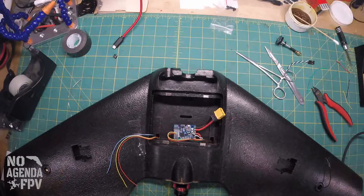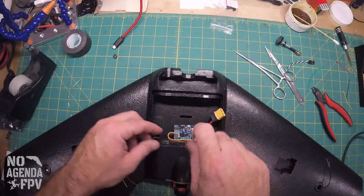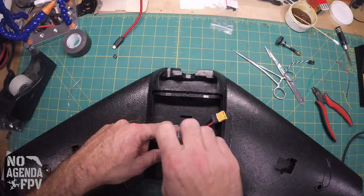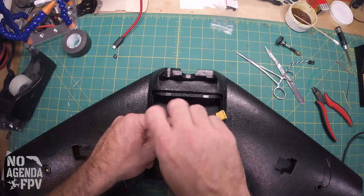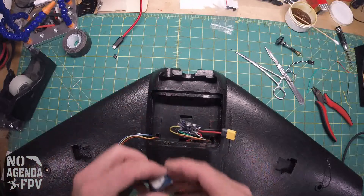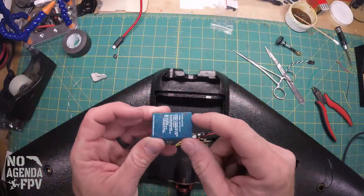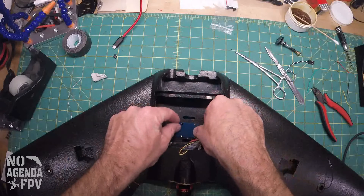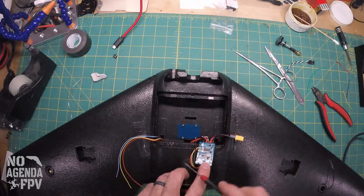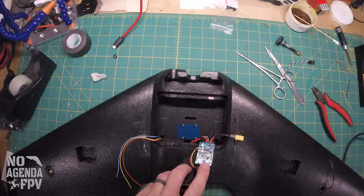I'm going to take a screwdriver and take these top screws out. Use your handle and magnet right there to hold them. We're going to disconnect that pad and then glue this one down. Loctite one of these screws in so they don't come off. Once this is glued down, that will still allow us to get to the bottom plate. This is the barometer — we need to put a piece of coarse foam in between so you don't get a wind effect on it.